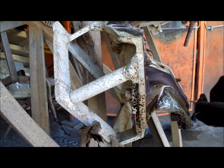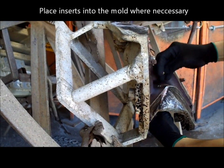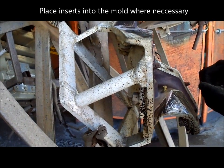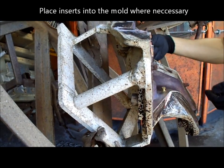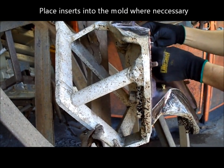This will begin by placing the threaded inserts into the mould. He's holding a bushing from the outside and screwing the insert to the inside of the mould. This ensures that the inserts stay in place during the moulding cycle. We'll talk more about this later on in the next stage of the video.